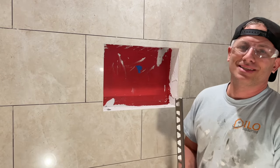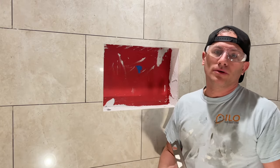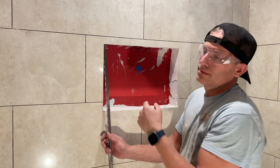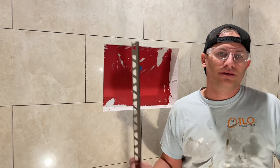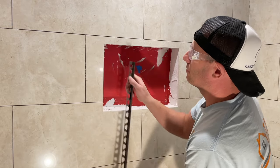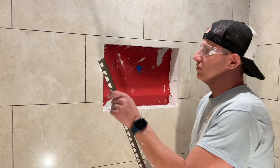Welcome back. Today I'm going to continue the video on how to install a custom shower niche — specifically how to tile it. Everyone tiles it differently. There are two trains of thought: you can either use the jolly to frame it out, which is my preferred method because it matches the schluter jollies on the sides of the tile and looks more uniform, or you put it flat and sneak it in on the inside for a smaller frame.